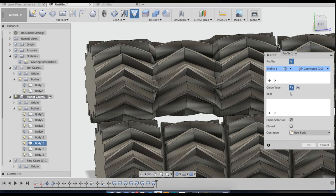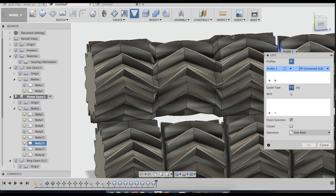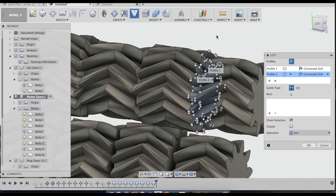A cylinder would have to bridge around the outside of the teeth, and you can't actually bridge with a line that isn't straight because there's nothing to hold the plastic there. So if you're going to bridge, you'd need to use a polygon so that as it leaves each tooth, it's still going in a straight line. But then you're bridging in the area where your teeth need to engage and various things like that.